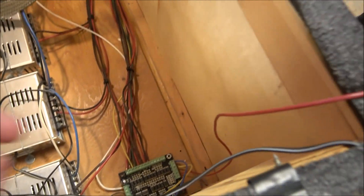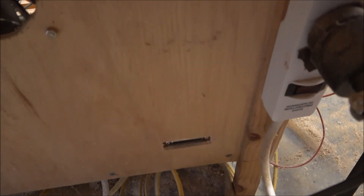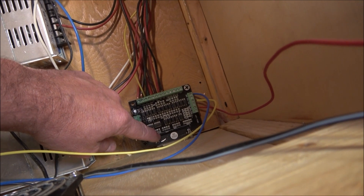The problem you're going to run into is that newer models use Mach 4. So the difference on my system is that your breakout board, instead of having all wires with the serial port plug coming out the front, you're going to have a USB port that can just plug into any USB port on a computer — much simpler setup. Like I said, when I was trying to get this going it was kind of a mess; everybody said Mach 4 was a nightmare at the time. Also, something I forgot to point out: the controllers — those silver boxes on the bottom — are all wired identical to one another, all put in the same ports. At the end of this video I'll let it slow-scroll through all the pictures so you can see kind of what I've got there.